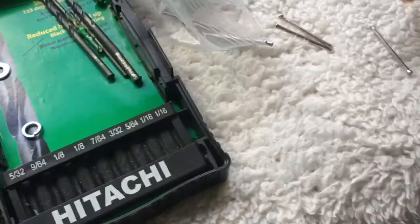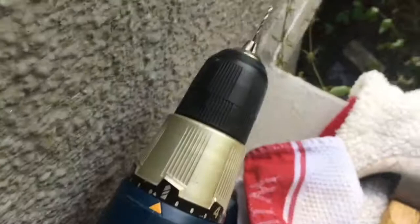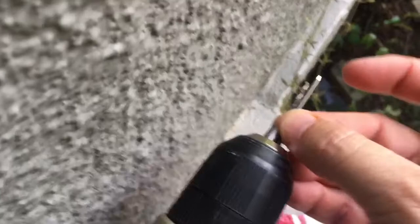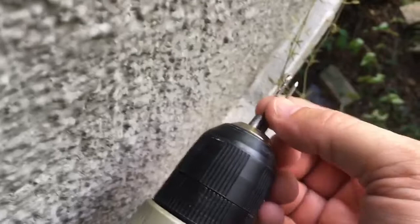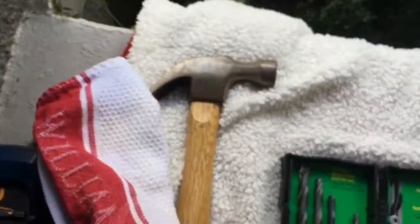So when I installed the bit in my drill, I made sure that I installed it in such a way that it would not drill accidentally all the way through the runner. In fact, I made it so it wasn't quite as long even as the nail. And while it is fractionally smaller than the nail, I still left it short so that while it was still a tight squeeze through the nail, the drilled nail hole area from the drill bit, I still had fresh wood for it to pinch through, and I was able to strike it through nice and clean.